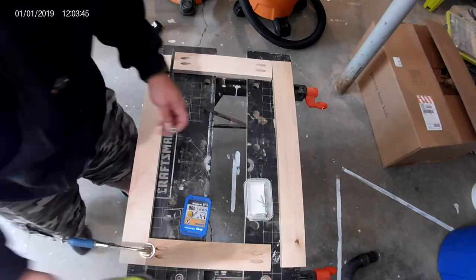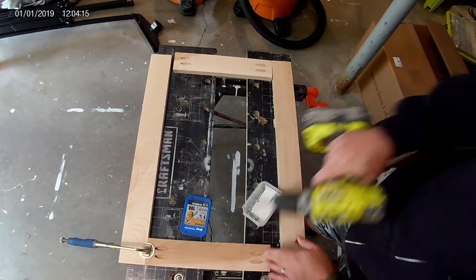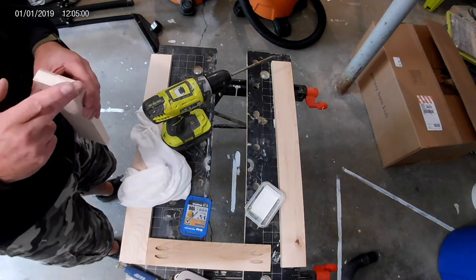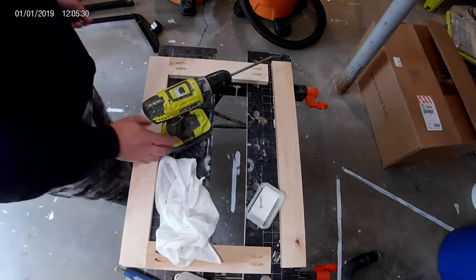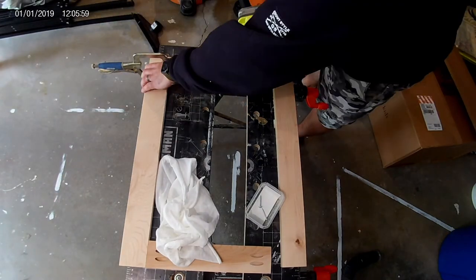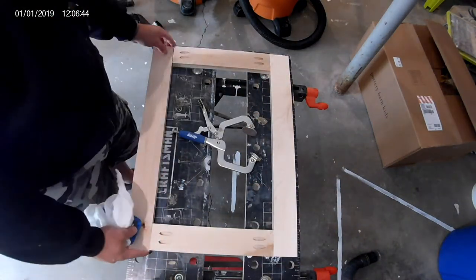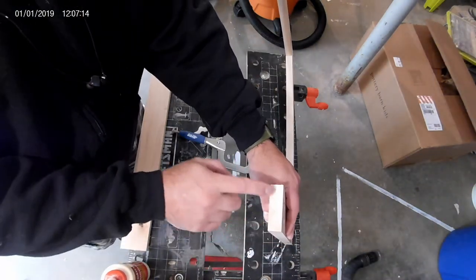Here we're making the shaker style door using the pocket hole method. You can see I've already drilled the pocket holes for this. I'll show you me drilling the pocket holes when I do the file cabinet, but I'm just gonna use a little bit of wood glue on the end grain there. Make sure that it's in there, kind of spread out with my finger. And then I'm using a fine thread screw, or a pocket hole screw. And I'm just gonna keep doing the clamp and making sure that everything's nice and flush, nice and square. And once this is done, we can go on to routing.